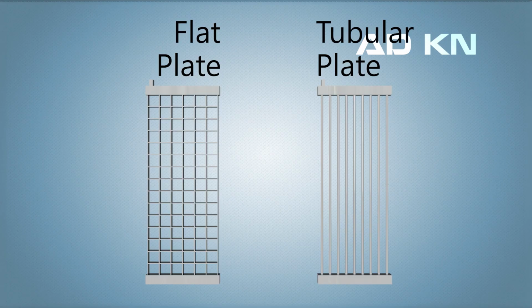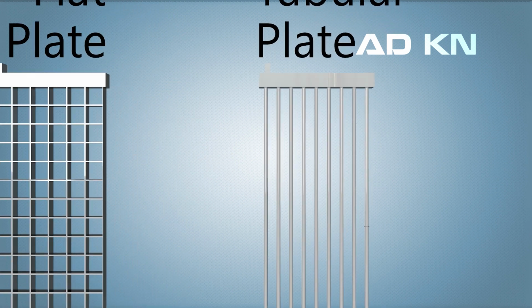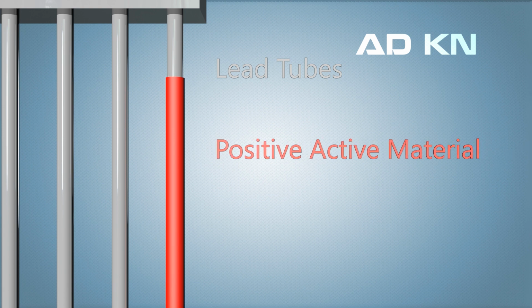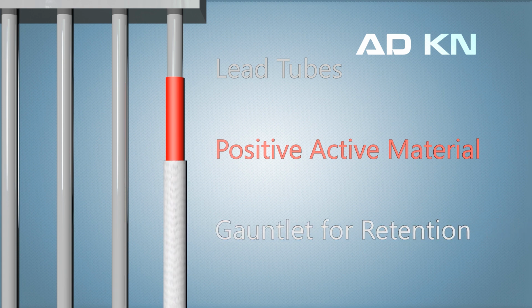Now let's look at the tubular battery. On a basic level, tubular batteries use tube-shaped structures for their plates, and due to this design, they are called tubular batteries. Its bare lead tubes are covered with lead material, in this case a lead dioxide positive material, and then covered with gauntlets. Gauntlets sound kinda scary, but basically they protect the covering material, which is the lead dioxide, making sure it is in place. Usually gauntlets are made of special fabric for battery use.